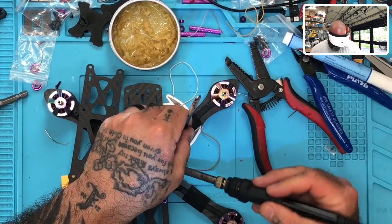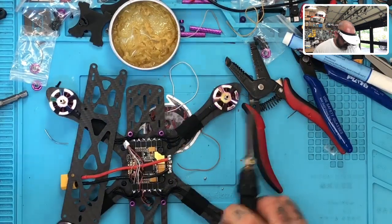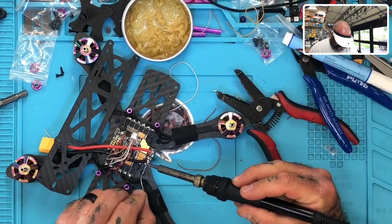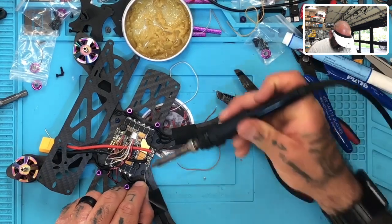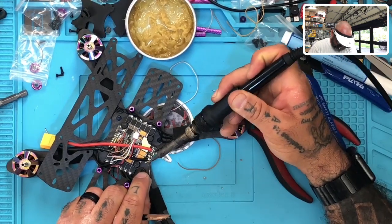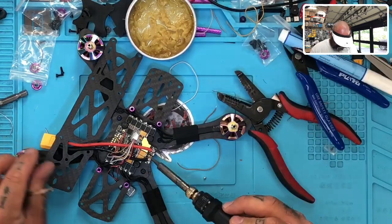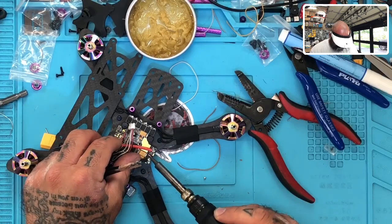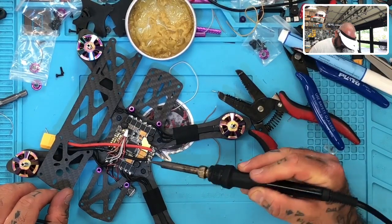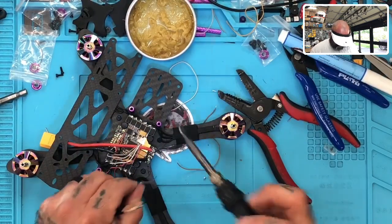And then I will press it against the new layer that I just opened up, and it should kind of paint itself on, okay? So it should allow a nice smooth ridge to form. And that will become a pretty strong ground solder, all right? Or ground connection, I mean, with solder. So I'm just going to slowly, I guess, like paint it on. And by doing that, it will absorb into there, and then that entire wire will spread itself nicely onto the pad, just like that. Now, you gotta be careful because this is pretty hot, so you don't wanna sit here and burn your board out. So a couple more seconds of this, and I'll be done, because it is warm.